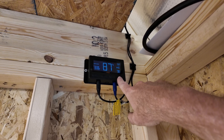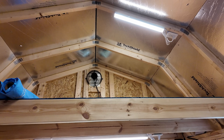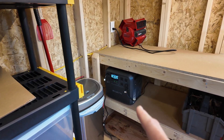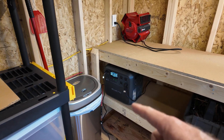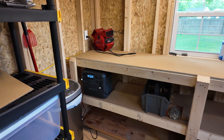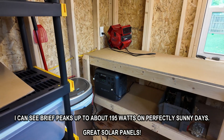It is a 10-speed fan and at the highest speed it only pulls about 20 watts, so it's pretty efficient. When it gets really hot in here that fan will kick on automatically and start to pull some of the heat out of the ceiling area. That's mostly because of concern for the battery unit — batteries don't like getting very hot and I want to extend its life. They're already going to experience a partial cycle every single day just from leaving the inverter on. I'll let the fan run during the day and 20 watts isn't really going to impact much, since I'm charging at about 180 watts during the day.